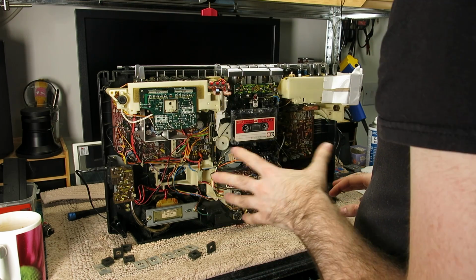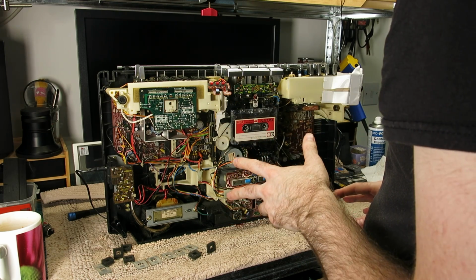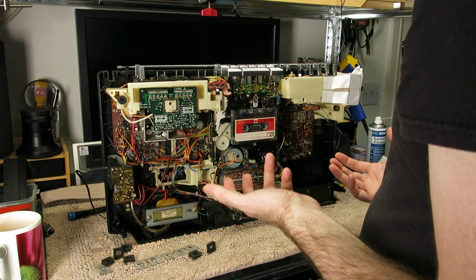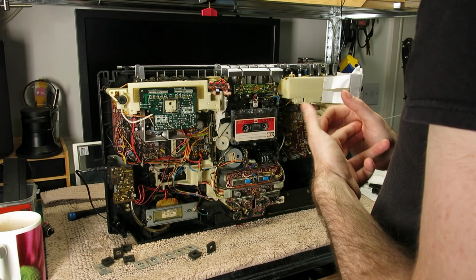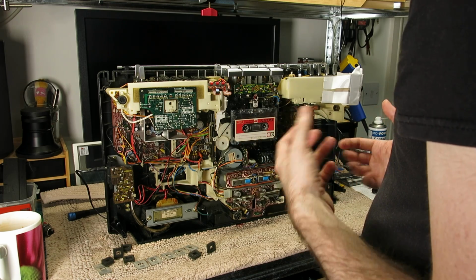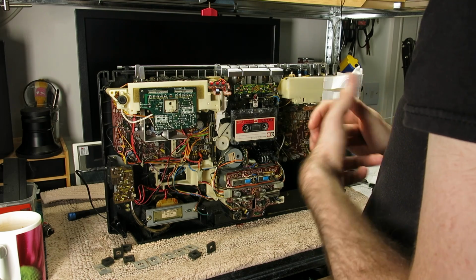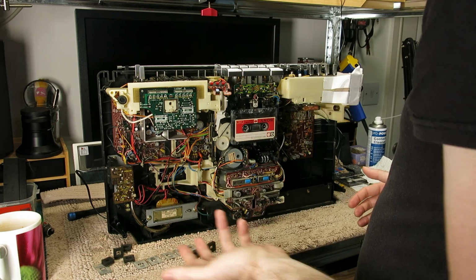As I say, because I was going over all this last night, testing out the functions, I discovered something that absolutely made my head fall off. The echo control, you would expect that that would just use a BBD chip, a bucket brigade delay chip, which is the really common chip that was used in most karaoke machines, analog delay guitar pedals, and that sort of thing. Really cheap and cheerful chip, commonly made by Panasonic, I believe. I think there was one that was very popular in the guitar community that they stopped making around the mid-2000s, and there was an uproar about it, but really common to find those chips. I fully expected that this would use a BBD chip.